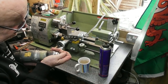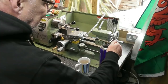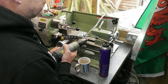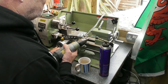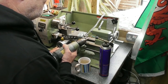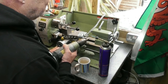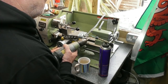So we're going to anneal the end of these levers. I've got them in the drill — old coffee cup full of water, blow lamp. I could just hold in a pair of pliers. I want to get the end not glowing, but hot hot. I'll see the colour change. It takes a bit — I haven't needed to anneal a lot of brass over the years.